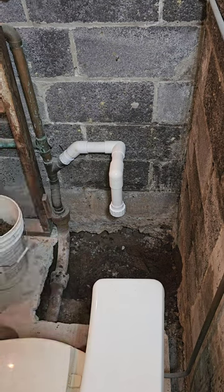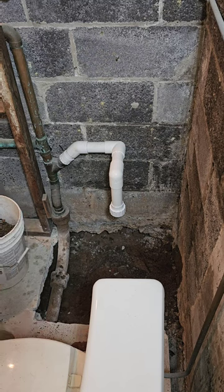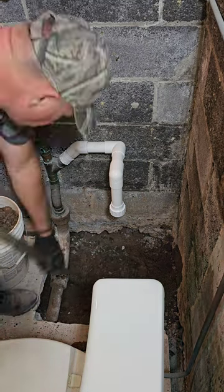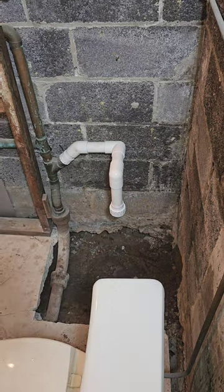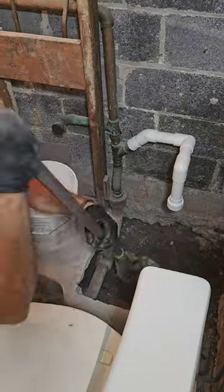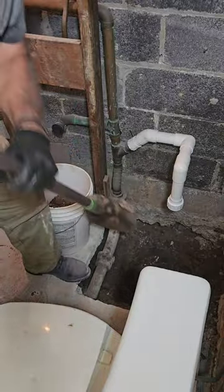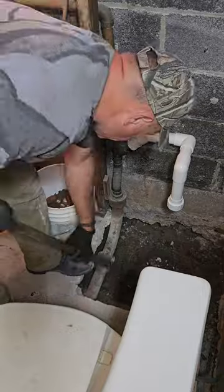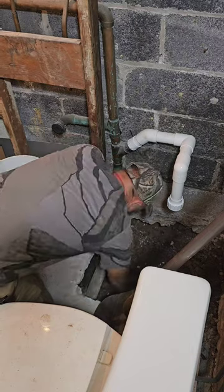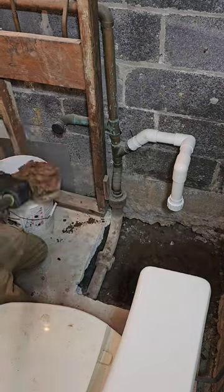He's gonna dig a nice tunnel — what we're gonna do is place a regular sump pump pit basin in there. I'm gonna drill a couple of holes in it, put stone all around it, and then reconcrete it back up. We took out probably eight to nine five-gallon buckets of dirt and filled it all back up with drain stone.